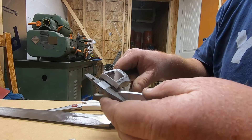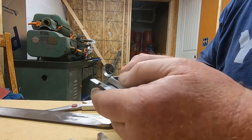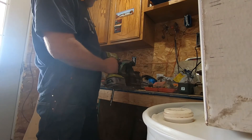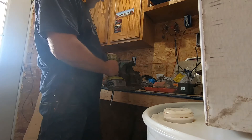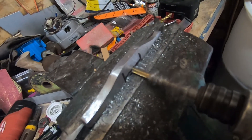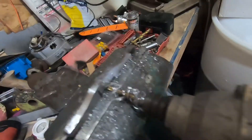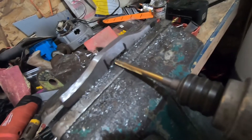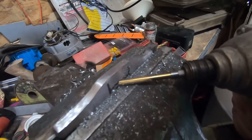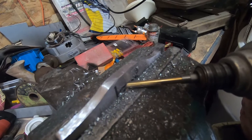I'm just making sure I got my marks right dead center. The best way I could come up with is just using this drill — I've done knife guards like this and it's really not half bad. You can get through this material and make a nice slot pretty easily in just a few minutes with a drill bit. I got it clamped in the vise sort of even with the jaws so the bit doesn't wander — that's a trick I learned. Once you get the holes drilled as close together as you can, you go side to side like I'm doing here with the angle, and that removes almost all the rest of the material and gives you a nice clean slot.